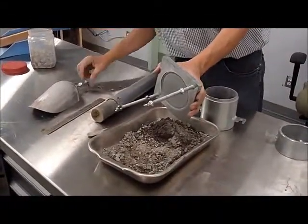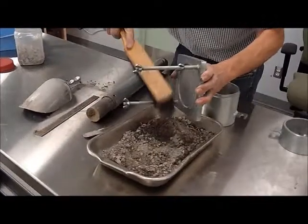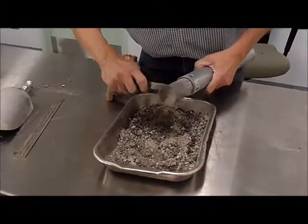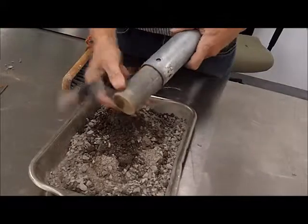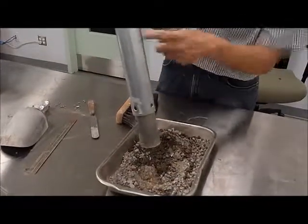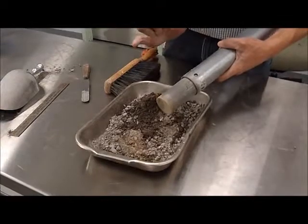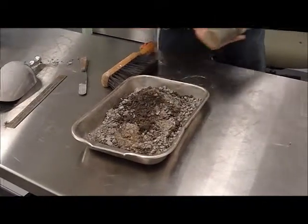Granular material is very easy to work with. In general, you find that simply brushing it removes all the solid material. The compaction hammer is typically going to have some material stuck not only to the bottom but also on the sides, and that could lead to errors. If you have sand acting as a friction area on the side, the energy is not going to be the same as with a clean hammer. So it's very important to inspect the test equipment when you receive it and to leave it in the same condition or better when you're done.